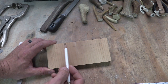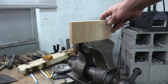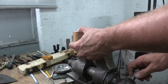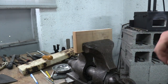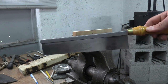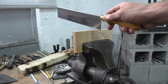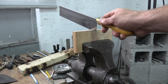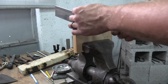We're going to cut this out and I'll show you the next step. I'm going to put my wood into my vise and tighten it down, then we're going to use a dovetail saw — this gives very fine cuts. Just be careful when you're cutting that you stay a little bit inside the line, because you want the thickness of the saw to remove that line.